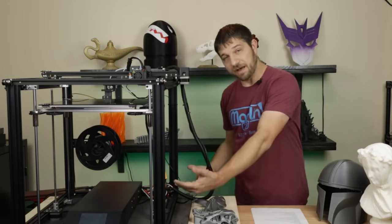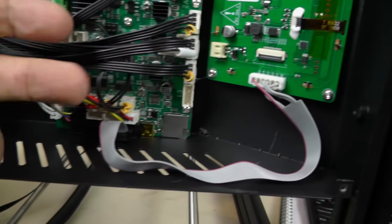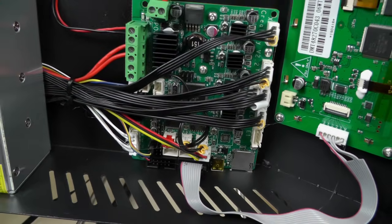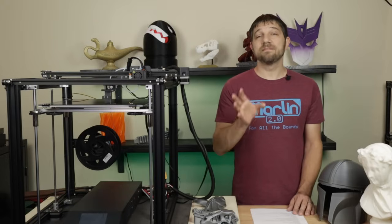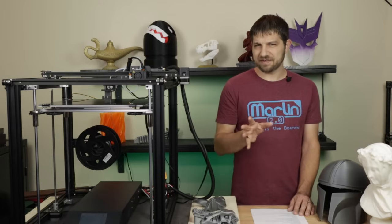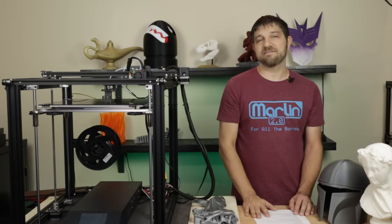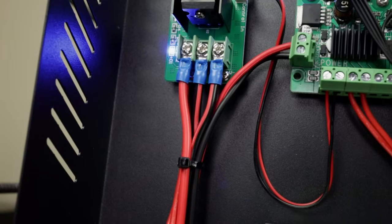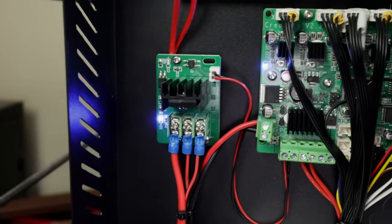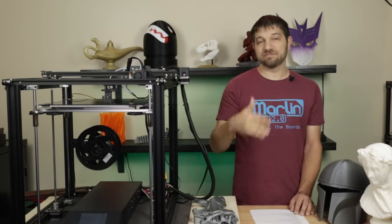Moving to the electronics at the bottom of the printer: this is a similar board to the CR-10, with a dual Z splitter on board. It does not have separate drivers for each Z — it has A4988 drivers. They're powerful but really noisy. I'm glad they used these over the DRV8825, which has a known issue creating salmon skin texture that requires smoothers. You don't have that problem with the A4988, but you do have a lot of noise. Nicely, there is a dedicated MOSFET for the heated bed, so this large print bed won't damage your main board.